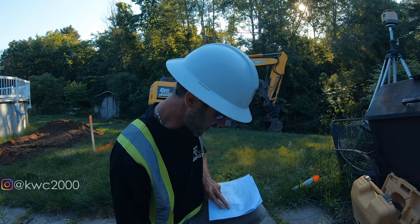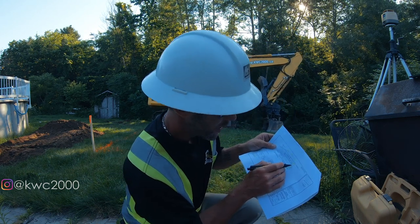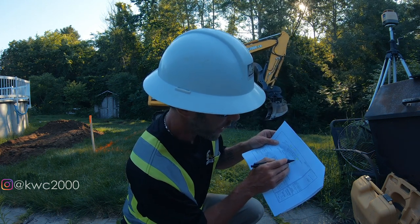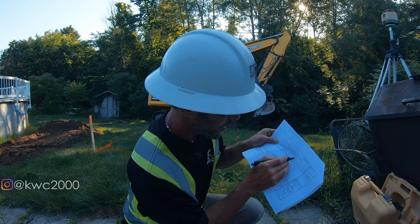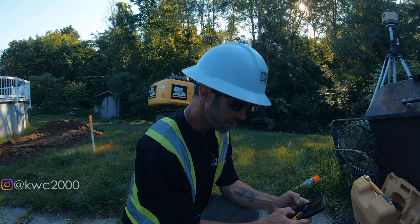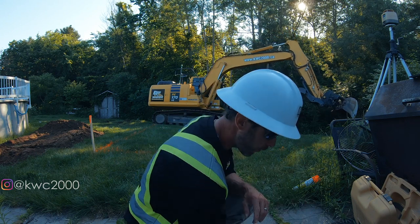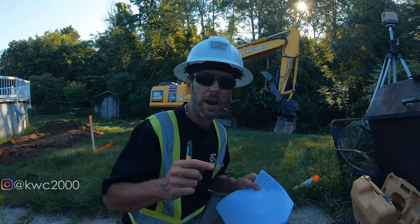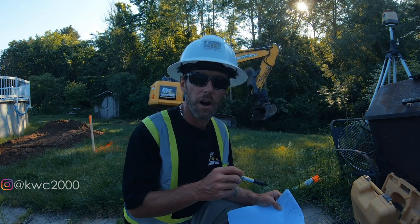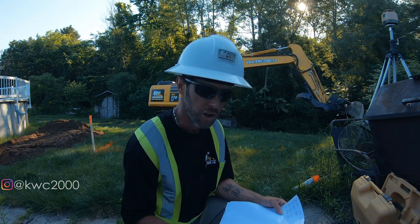And it all works the exact same way. So to find out my pipe elevation, I can take my stone, subtract 6 inches, because the pipe is 6 inches higher, which will put me at 98.20. So I can take my new benchmark, 100.74 minus 98.2, 254. Now I can take that 254 and verify it on my outlet to make sure I have enough fall to go from my existing tank to my new bed via gravity.